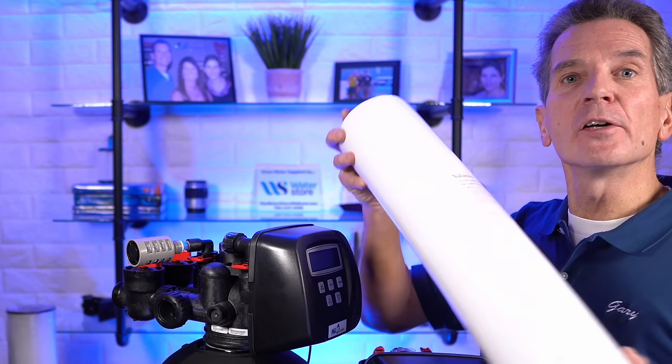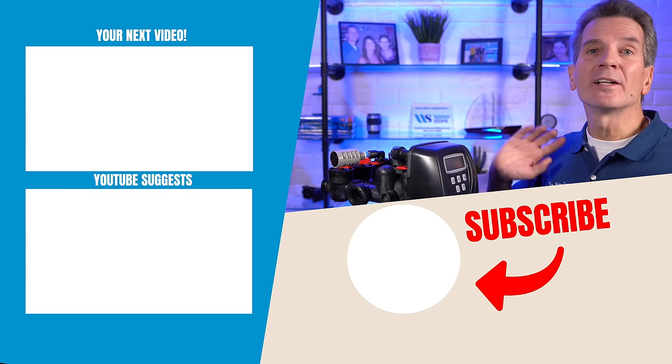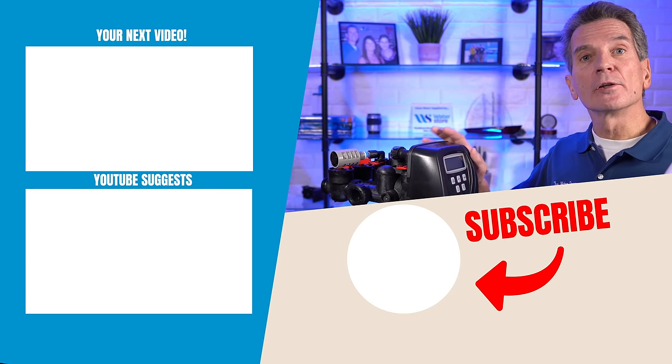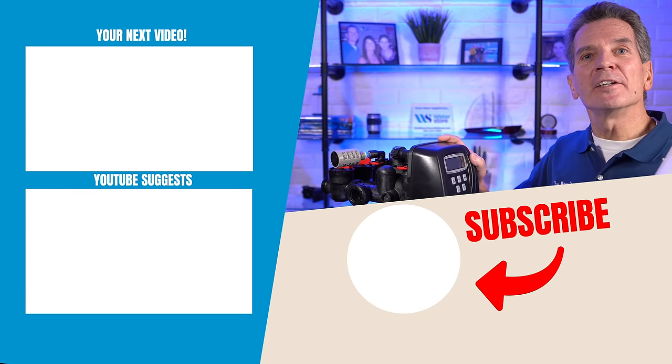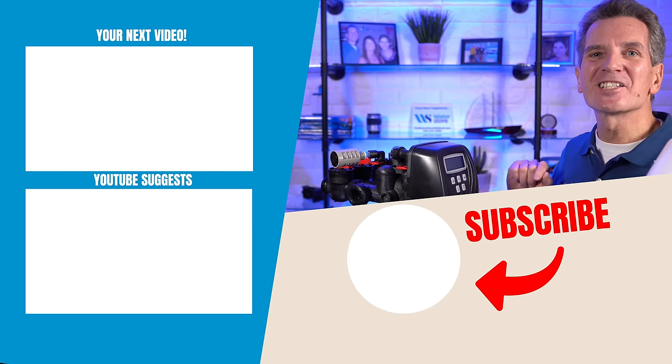So what's the cheapest way to get rid of iron from your well water for your family? You can definitely try the 1 micron sediment filter — super small investment to give it a try. If that's not working, you may already be getting rid of it with your water softener; make sure you use ResCare to keep the media clean. If you've got sulfur in your water, you need an air-over-media iron sulfur filter. With iron bacteria, there's no choice — you have to go with the chemical injection route. If you're looking for more information about iron filters and water filtration in general, click over here for my next video.